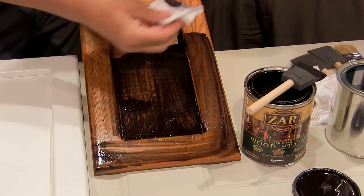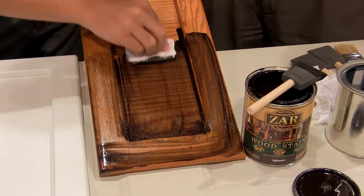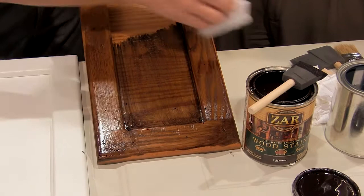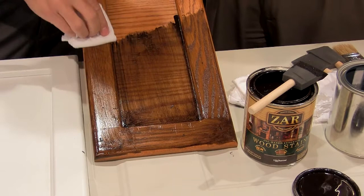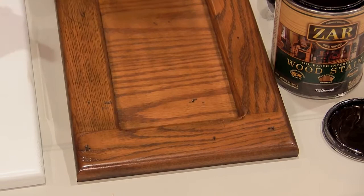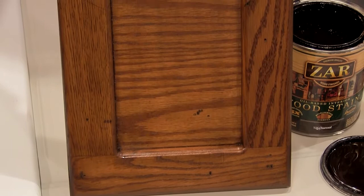It doesn't look like a huge messy bunch of stain on it anymore — it's starting to get some definition. It's fairly easy to do. And you'll see that really changed the color and tone of the door. But I can still see the grain through that color. Right, and that's what glazing is right there. It really pops that grain and gives it an updated look. It kind of accents edges as well. It gets in all the distressed areas and grooves and it looks nice.